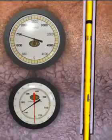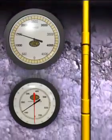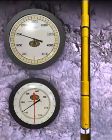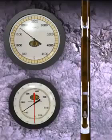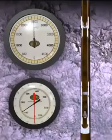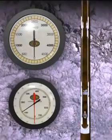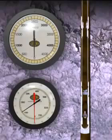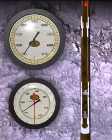The liner is now hung with the shoe several feet off bottom, and the liner casing is in tension. To regain circulation, the setting ball is blown out by increasing surface pressure to shear the pins in the seat. Circulation is re-established and the well is circulated until smooth and steady pump pressure is observed.